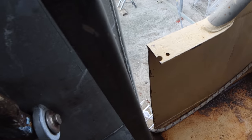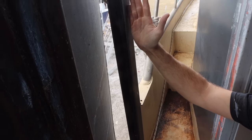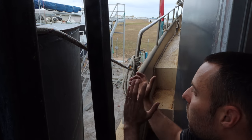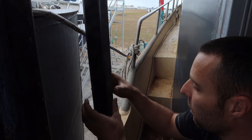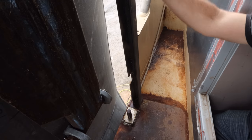The other side in. Close this side, put in the plastic sliders, the plastic wear strips. You can see we've had this strip in, just sort of sitting there. Yeah, and it worked great. There's a lot of noise because there's a bow on this side. This side is bowed back towards the back of the boat about 3 or 4 millimetres. So I'm going to pull it forward about 5mm between here and the handrail. I'll put my endless chain and just compress it and pull this forward slightly, and then I'll build all the sides in and weld it like that, so that'll hold this in the position I want.